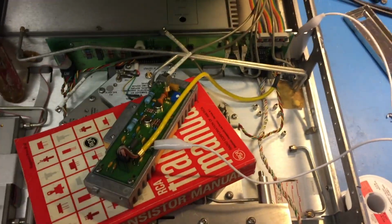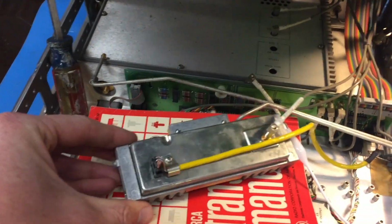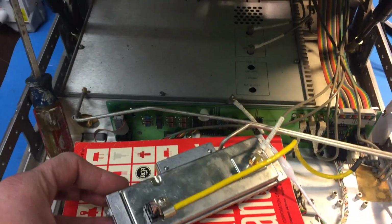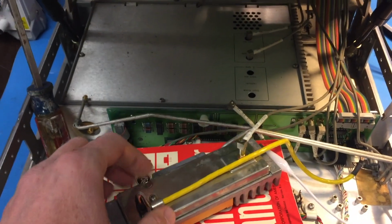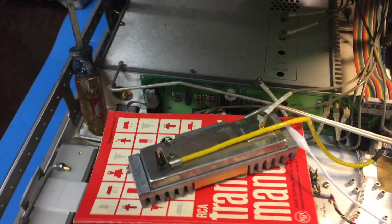I don't see any short circuits on this thing, so I'm going to reassemble the whole thing and try it out. And I'm just building this thing up one step at a time, because with an intermittent problem, to make sure you cleared it, you want to make sure that none of these pieces like the case or this, even the fasteners, are causing the short. So far so good. The short is back,